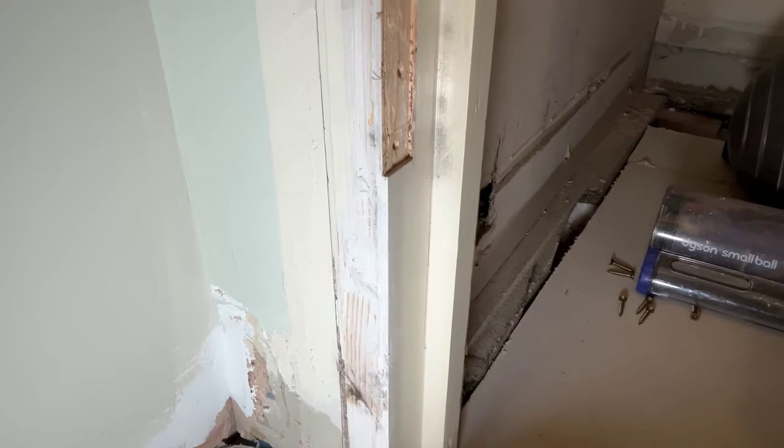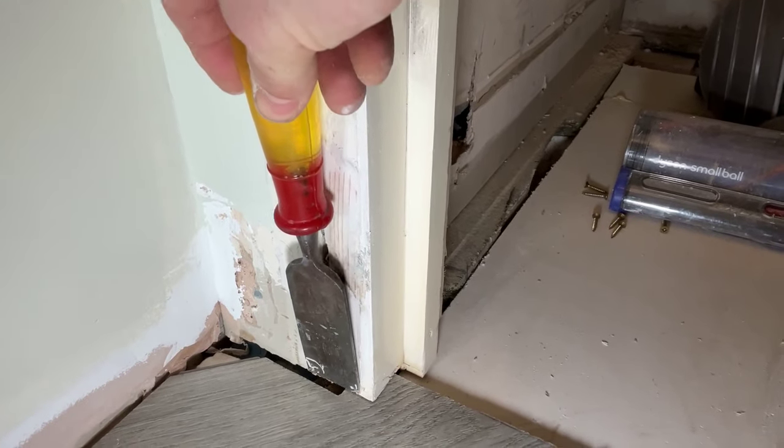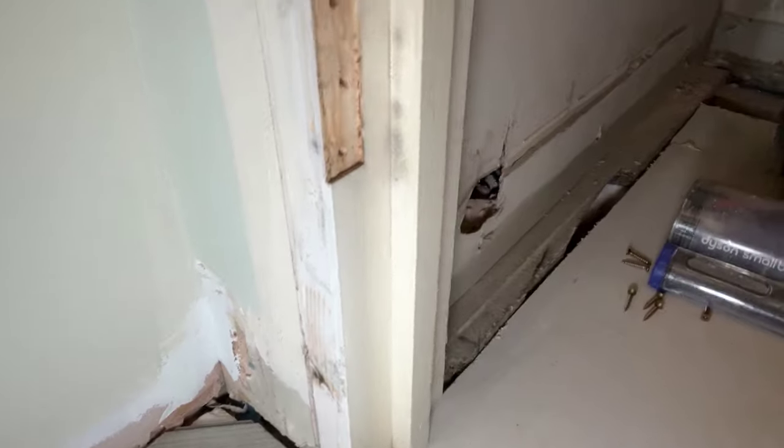This has to be inside the frame, because you've got the architrave, and that's how it's gonna cover. So you won't see any gaps there. I'm just missing that little triangle. But yeah, this is pretty much how you do those tricky bits around the frame and the wall, where you have to pull back your board. You cannot click it, because you have to slide underneath and then slide back to the rest of the floor. So I hope you find it helpful, and that's it. That's pretty much how you do it.